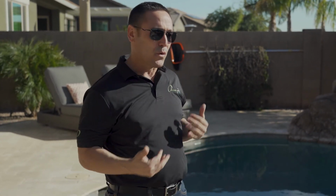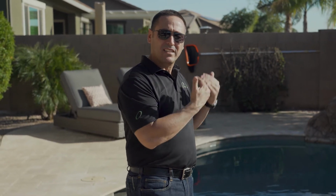His actual setting is at 120. 120 is for 10,000 gallons. So for him specifically, those three 20-pound tanks, instead of lasting him 6 months, are going to last him closer to 10 to 11 months. The reason is the pool's been in the ground for a long time. It does not have a high requirement for acid because of high pH, so it's not going to have a high requirement for CO2. So again, we installed this system, we put it on a recommended setting for 18,000 gallons, and we came out and his pH was at 7.0. So we started dialing it back, and right now he runs it at a 10,000 gallon setting, which is a 120 setting with a flow rate of 2, and he's getting a 7.4 pH every single day.